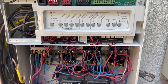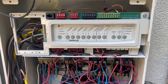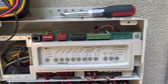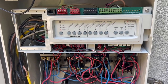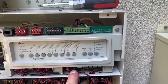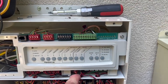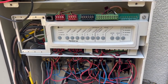So go ahead and turn them from one position to the other position, and when your fuse fails and trips, that's the actuator that has to get replaced. The same would be true for the relays. If you turn a relay on and the lights go out, then that is the relay that is shorted. As it turned out, our return actuator has failed and is shorted. So when it goes from one mode to the other mode, it blows the fuse out. We're going to replace that return actuator, and the problem is now solved.